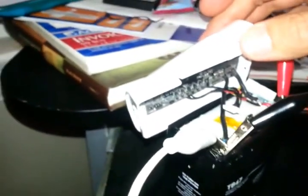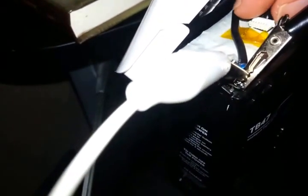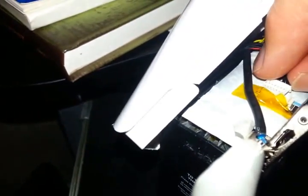Once you get the cover off, it talks about unplugging the battery loom. I'll include the link to droneenthusiast.com. They say to gently disconnect the balancing plug slash loom to the IC — I have no idea what an IC is, but I assume it's the computer board inside there. I just took a while working it with my fingers on both sides and gently pulling on the cord. I pushed really hard on the little tabs with both fingers, pushing from the back side.